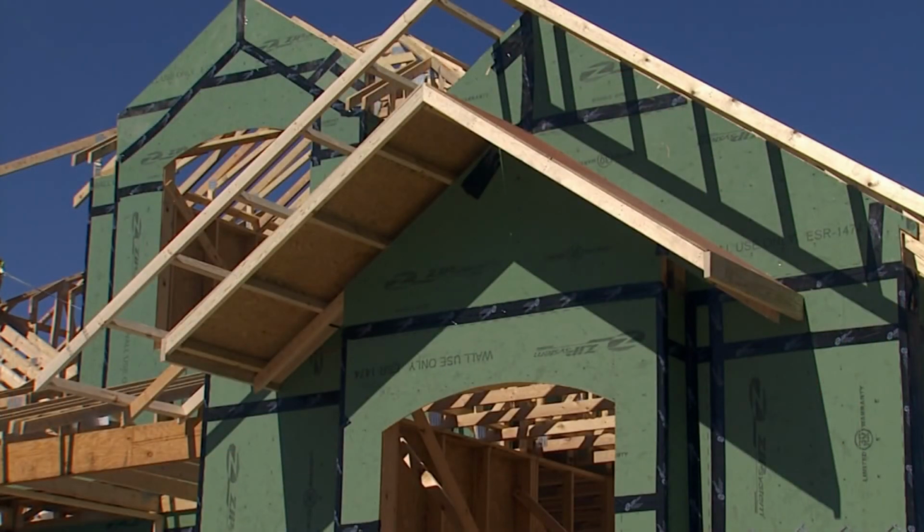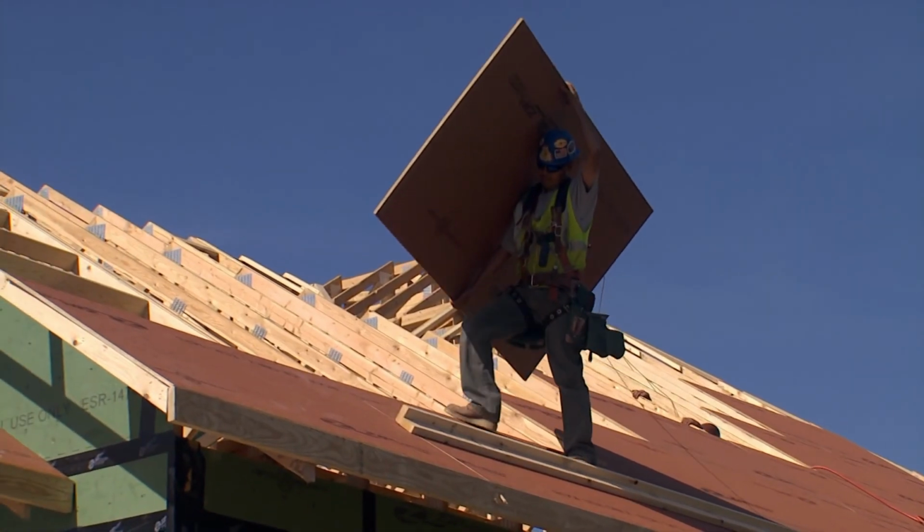Some people use, again, the poly as a vapor barrier or something like that, but that also forms an air barrier. And then you tie that back to the air system in the walls. And then you've got a big open air space up above. And then you've got your sheathing and your rain shedding layers up on there, shingles, metal siding, whatever your roof system is, clay tile.